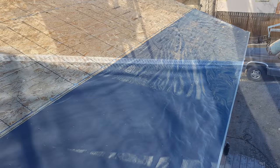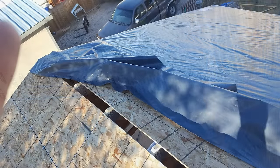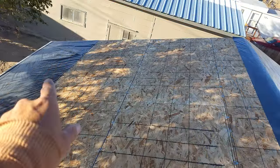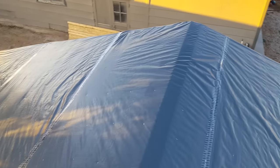For an additional step, you can also seal all the seams of the underlayment with seam tape, which really comes in handy when the underlayment is installed and exposed to windy conditions, which may damage the underlayment. The second row of underlayment should overlap on top of the first row, then the third row should overlap on top of the second row, and this pattern should continue on until reaching the peak. Then at the peak, I slightly wrap the underlayment to the opposite side, then stop. Then I begin installing the underlayment on the bottom of the other side and work my way back up towards the top with another slight overlap to the opposite side. And with all the outside edges that do not have trim at the moment, I let the underlayment hang over about one inch.